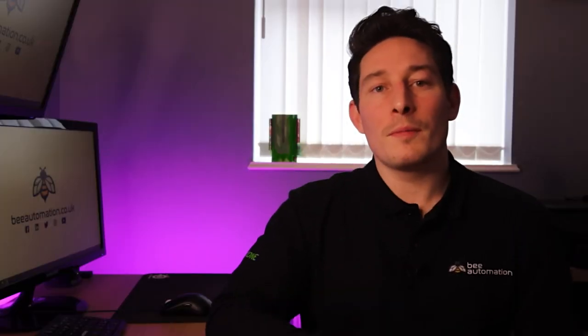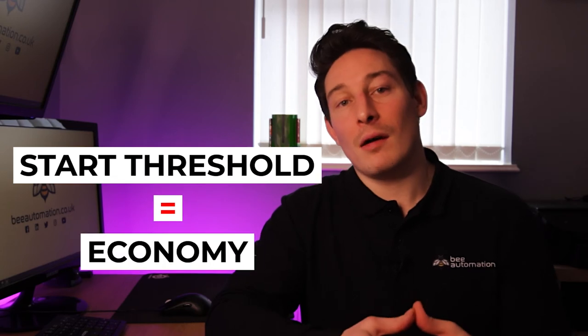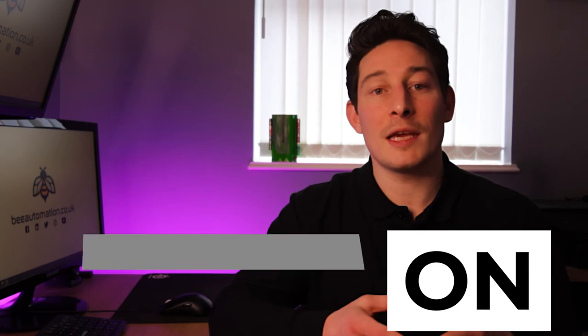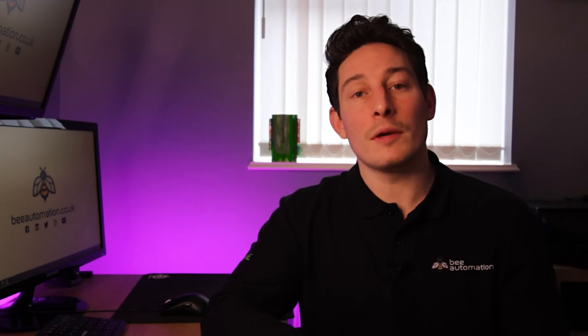Start threshold. The heating start threshold is a setting which basically decides how economical you want your heating system to be. So let me explain. The start threshold decides when the heating source, a boiler or air source heat pump in most cases, switches on based on how much heat the rooms in your home are calling for.